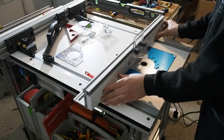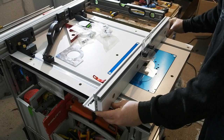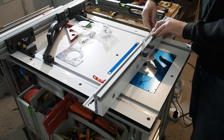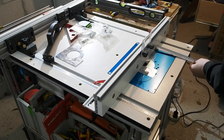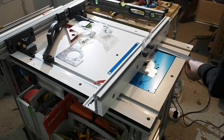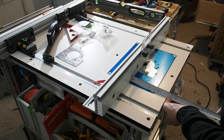On the face of the router insert plate are laser etched millimetre markings. I'm just aligning the fence to them to see where we're at and if they're true to the edge of the table — turns out they are, with centre marks 161mm from the table edge. Router cutters being round, fence square to the plate or table isn't fundamental like it is to a table saw, but I just like to work this way, knowing all components relate to each other.